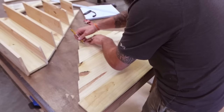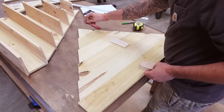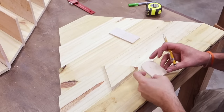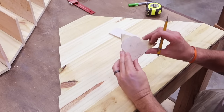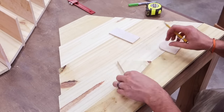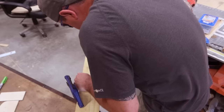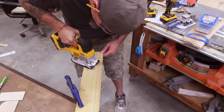For the top we're doing things a little differently. For part F we are only going to be tracing out a portion of this jig — drop it down about an inch, whatever looks right to you. It really won't matter because the cornice, or the gingerbread as I'll call it, will actually cover this hole up. Now that we have all of our doors traced, it's time to break out the jigsaw and get to work.